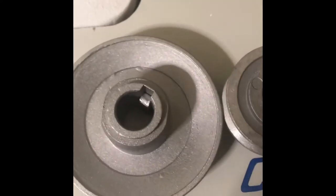So comparing them: 75 millimeter old, 45 millimeter new — it's a lot smaller. I haven't got the speed reducer yet but I'm preemptively getting my hole expanded where the belt's going to go. From what I've seen, the belt drops straight down where the pulley will be right under the table. My whole bracket and stand are going to have to move over almost completely to the end to allow room for the pulley.